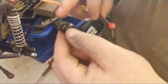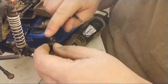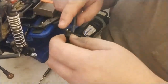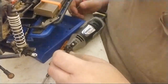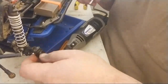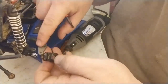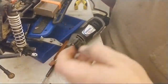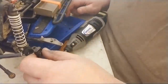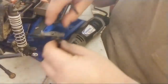Put the C-hub back in. I would take the truck, lift it onto an angle, and then place these pieces in. They're not grub screws, but the spacers, because on top that's what allows this piece to turn with fidelity. And then I'd lock these up and tighten them down pretty decently. Use a little blue Loctite, and then I'd cinch this back down onto the C-hub.